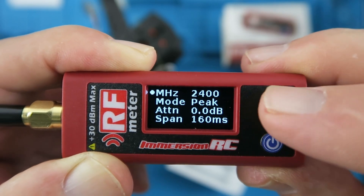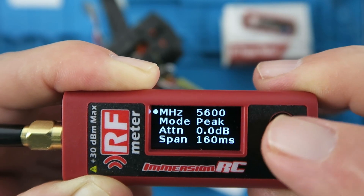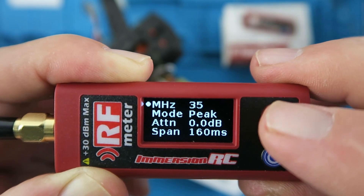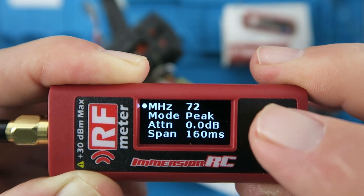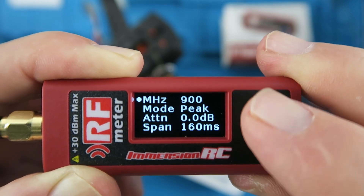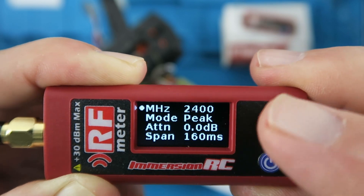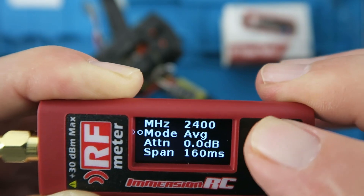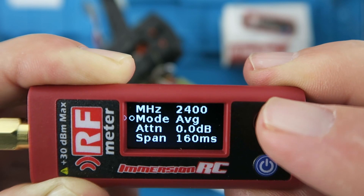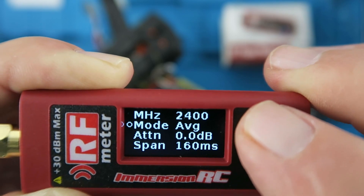On the main screen we can get to the frequency settings. We press the little toggle, go to the right to select, and then we can change our frequency. We have the upper frequencies for FPV, and then 35 megahertz for the older type radios, 72, 433, 868 as shown at the beginning, 900, 1.2, and 2.4 gigahertz. Once you've selected the frequency, just press the back arrow. We can also set peak or average — average is more useful for analogue type systems, so for non-continuous or digital type systems like our transmitter, we set that to peak measurement.